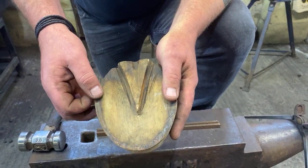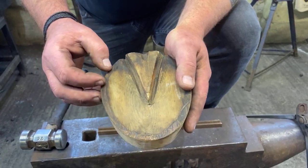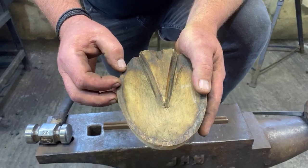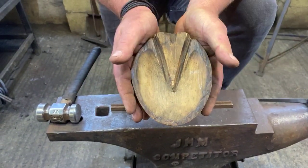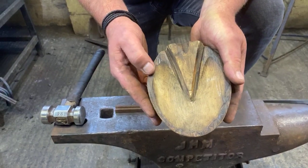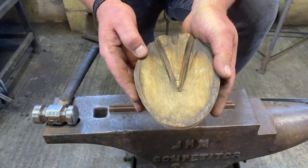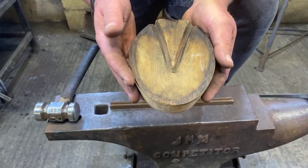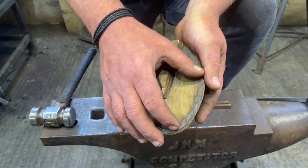So when we go on about nails being too coarse or too fine, we are looking at very far back, fine nails. In a lot of cases, for a foot this big, I'd normally nail on with a 3 slim. You're probably going to have to stitch that on with a 2 slim or a 3 slim, because it is so far back. So very delicate nailing. One thing that will mean is I'll probably put 4 nails on the outside as opposed to 3 to give a bit more stability.